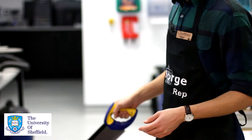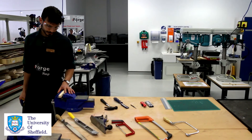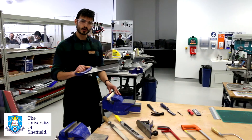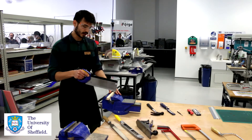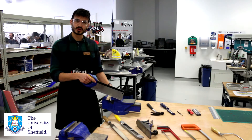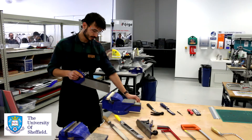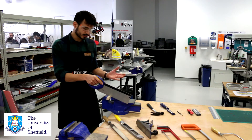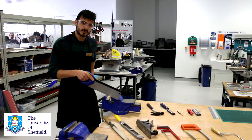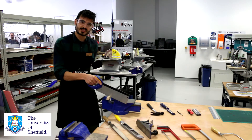When walking around, just make sure you have the saw down by your side so that if you fall over you don't hurt yourself. The proper technique when using these saws is to always ensure that your finger is out along the saw and you have a proper, strong stance so you're not going to fall over. Remove the shroud when you're ready to start sawing, ensure you have a notch, keep your hands out of the way, and use the whole length of the saw so it doesn't skip out.